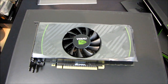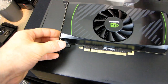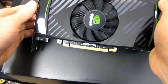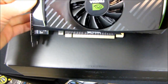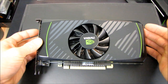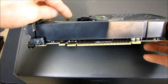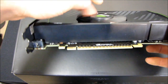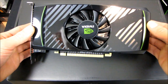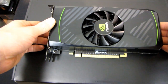Here it is — this is the GTX 550 Ti. It features a very similar look to the 560 Ti reference design card. That is the central fan with a flower-style heatsink. If I spin this you can see the heatsink a little bit better. Unlike the 560 Ti, this one does not require a heat pipe cooler for optimal performance, so NVIDIA has opted just for a standard flower heatsink cooler. The shroud is recessed a little bit, just like the 560 Ti, so the fan actually sticks up a little bit above the top of the shroud.